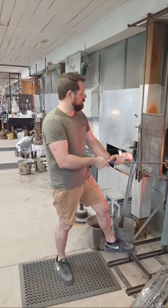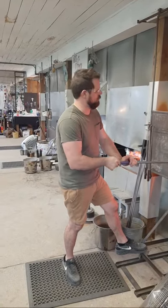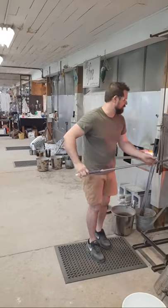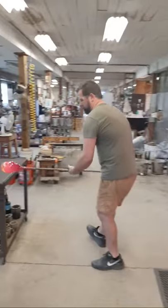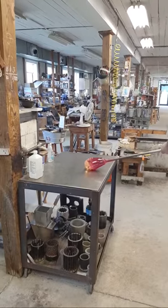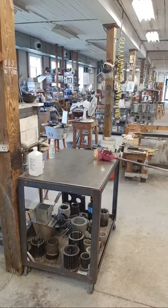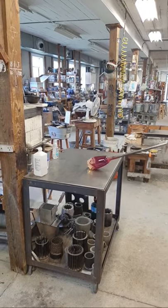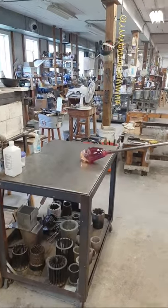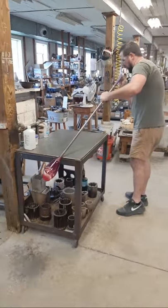The hooking distorted the shape a little — made it longer and put some indentations into the glass. Josh will work on smoothing those out so he has a pristine surface as he blows it out. This finishes the decorative aspect. He's back at the marver — by changing the angle of the iron, different parts of the glass make contact with the surface. In addition to constantly turning like on a lathe, he's constantly changing the angle so the glass encounters the surface differently.